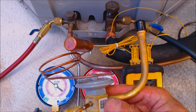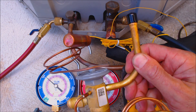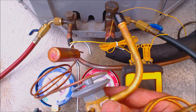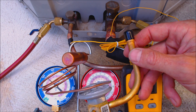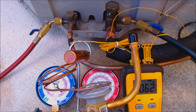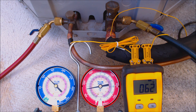There are three things at play with the TXV: the bulb pressure, which pushes downwards, and the spring pressure on the bottom and the external equalization pressure, which push up. The TXV's job is to maintain a superheat of roughly 10 to 14 degrees for air conditioning, so total superheat taken at the outdoor unit may be around 16 degrees. When you have an R410A TXV on an R22 system, you're reading a very low external equalization pressure. Because of that, the bulb forces the TXV to open up almost fully, so you barely have any superheat — in this case, zero degrees, or possibly just one or two degrees.